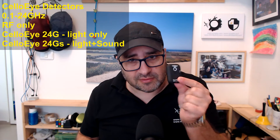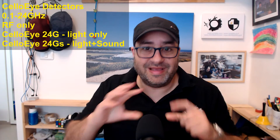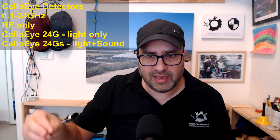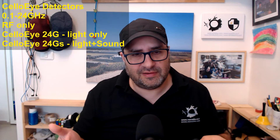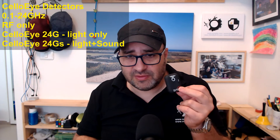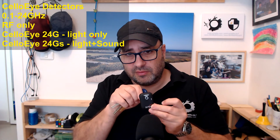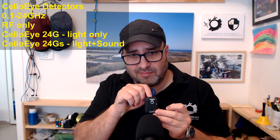The third device is not a meter, it's a detector. The difference between a meter and a detector is that a meter measures the radiation, while a detector just detects it. With a meter you get a numeric display or LED lights indicating the level; with a detector, you just get a signal — there is radiation above a certain threshold or there isn't. It's only for RF. This model comes with a speaker, so when there is radiation, it blinks and beeps.